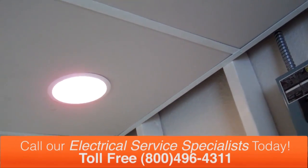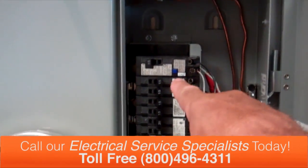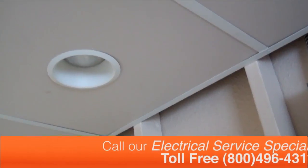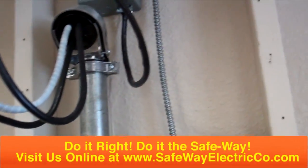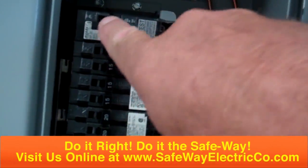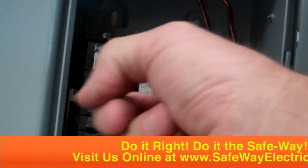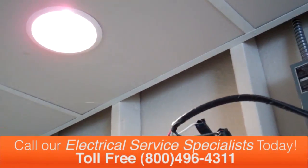I turn the light switch on and we have power. Now if I push this test button right here, we can see that the lighting went out. So the arc fault circuit breaker has passed the manual test. Simply reset the breaker by switching it all the way to the off position and then turn it back on — and now you can see that the light is back on.